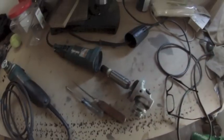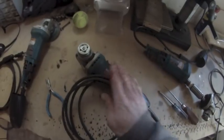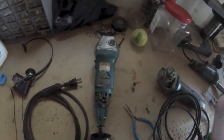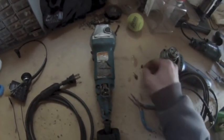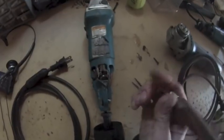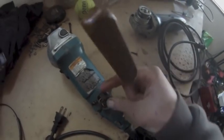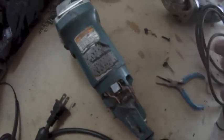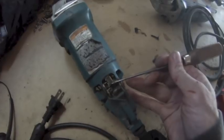Makita grinder number one lasted about 10 years, maybe more. Grinder number two lasted about a year — I thought since I'm working on the boat, maybe that's what did it in. Grinder number three only lasted six months, and for some reason I never thought of changing the brushes, which are actually really easy to get to. There's one screw in the back — all you have to do is pry this spring up, set it aside, and the brush comes up easily. This is actually a new brush — you can tell the difference. Then you slide it in and put the clip back on. Simple as that.